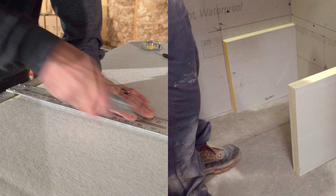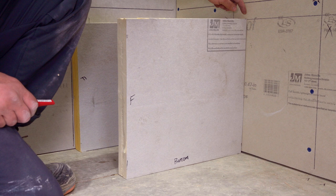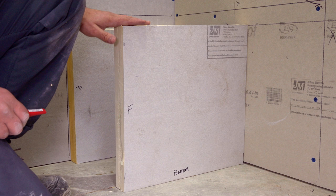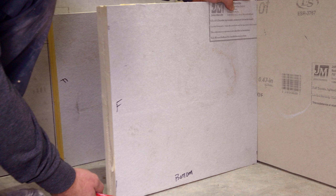So we have these ribs all cut and made, and now we're going to scribe them into the floor. I have a line here on the wall where this top corner needs to be. When I cut these, I cut them with slope on them already, so they're automatically sloped. I just need to get them to sit plumb on the face, which will give me identical slope on the top, but I need to scribe it into the floor so that all these are sitting on the floor.